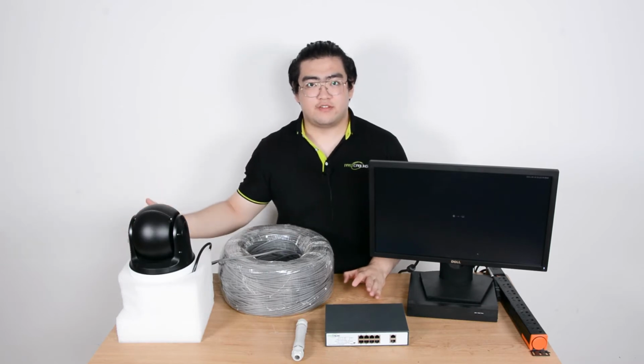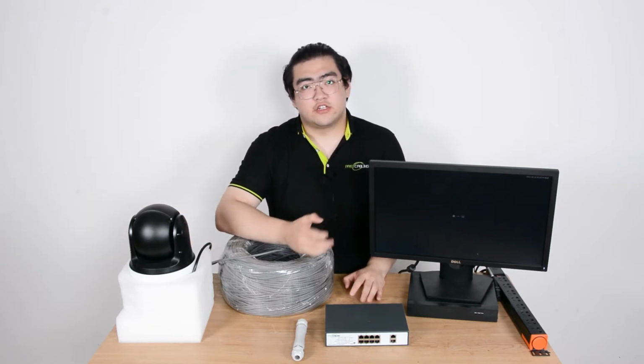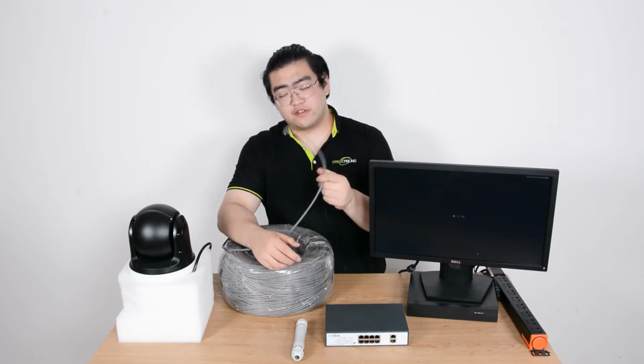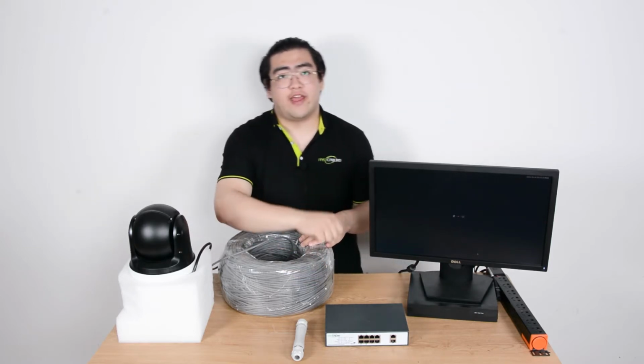Hello everyone, I'm Watson. In this video, we're going to talk about how to set up a PoE PTZ IP camera 500 meters away. PoE technology is the method of transmitting power and data through a single Ethernet cable. With this technology, we can make our IP devices much easier to set up because all we need is an Ethernet cable to solve both power and data.